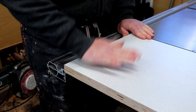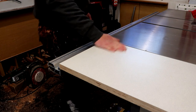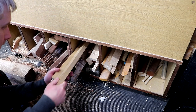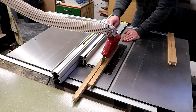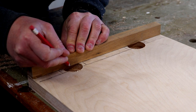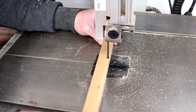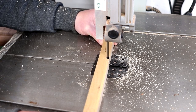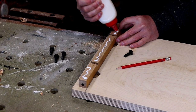With the bolts in and the plywood sitting on top of the boards it happened to be almost perfectly flush with the cast iron table of my saw. So I took a couple of scraps of hardwood and ripped them down at the table saw to create some rails that I can fit to each end of the table. I marked up where the bolts would need to be, cut out a notch for them, and then glued and screwed those rails in place.